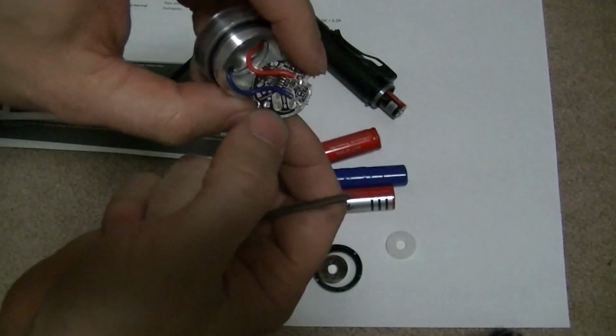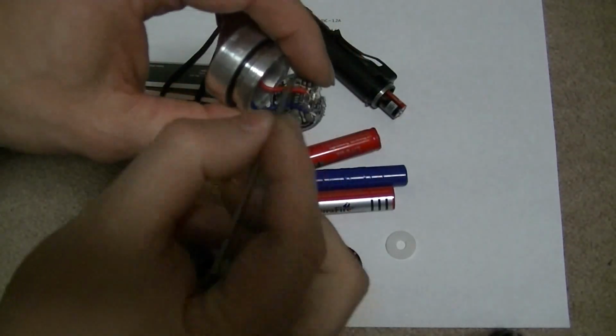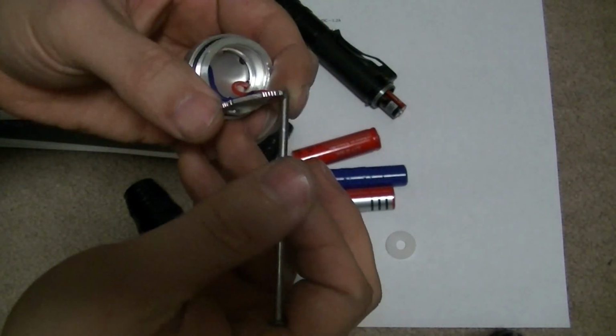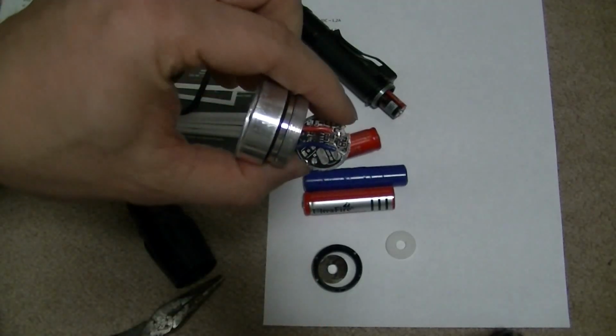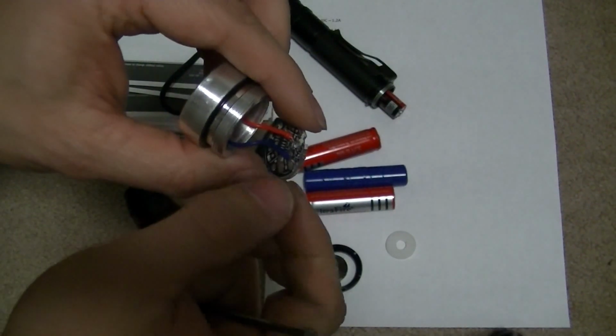And to fix this back, basically what I did was I took a meter from here, checking around different points until I found 0 ohms, which happened to be that one for the plus, and then from here on the edge do the same thing, which happened to be right there for minus. That just happened to be where I found to connect it.